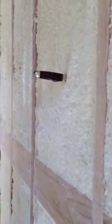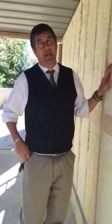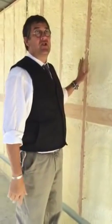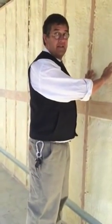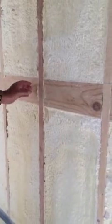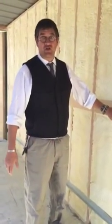That's my pocket knife sticking out of the wall. Once you spray this insulation in, it sticks to the studs and the metal and everything, so the inside of this container is no longer traditional framing and it doesn't flex like traditional framing. This is actually a solid membrane now that's connected with solid blocking. You can see in the wall how we've added blocking so that anything you want to bolt to the wall at this level can be bolted without any fear — we're talking about a bomber structural support.